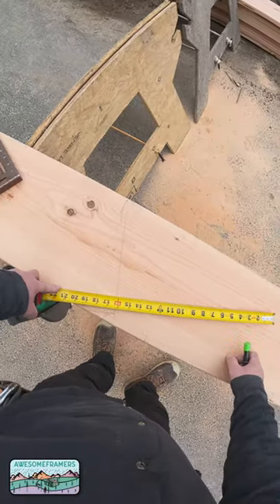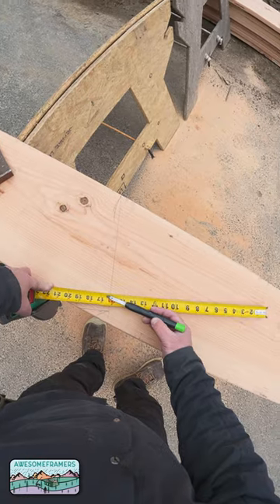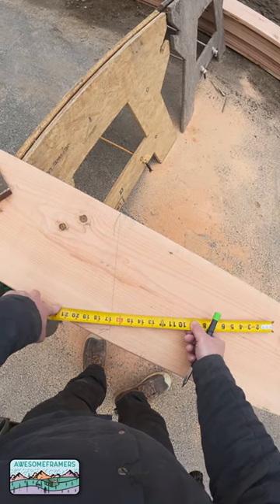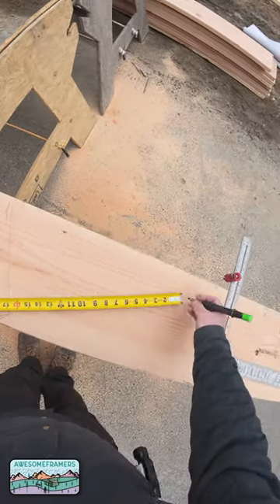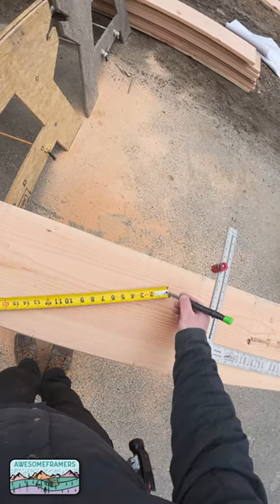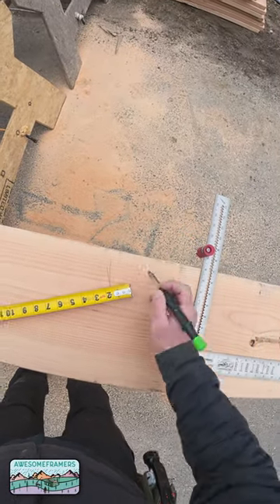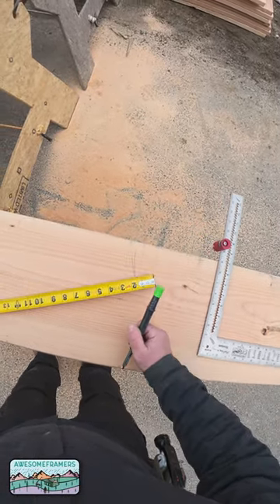Now for my tail, I just burned the amount. So we're using 16 inch soffit. We have 7/16 OSB zip panels and then I add a quarter because I like to have a little bit of slop. That's how we built those back walls. I mark the end — that's the back side of the fascia, or the outside of the sub fascia. An inch and a half is the back side of my sub fascia.